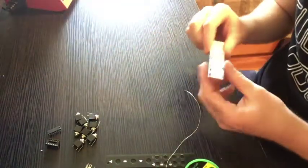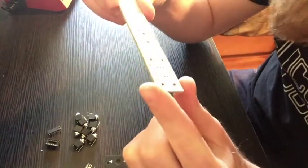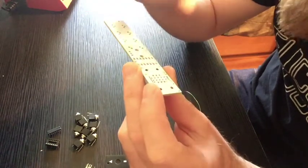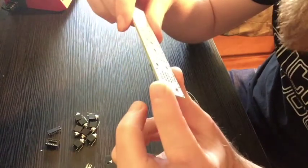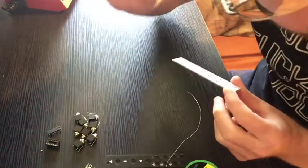You want to check your guy for bad solder joints, right? Cold solder joints, if the solder looks like a little blob that hasn't really fully adhered to the pad or the part. Just look out for that. Yeah, should look like little Hershey's Kisses.